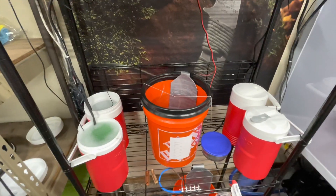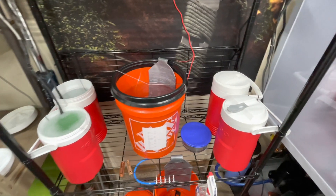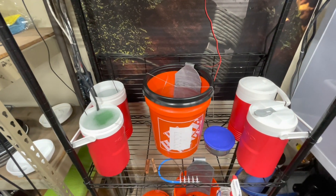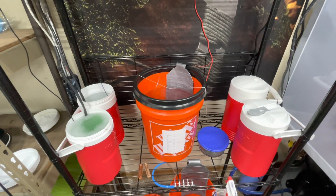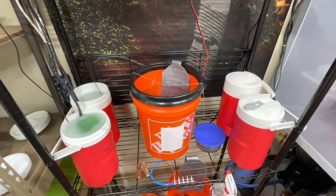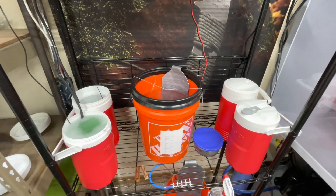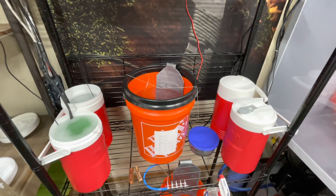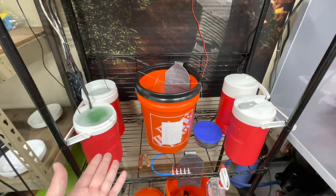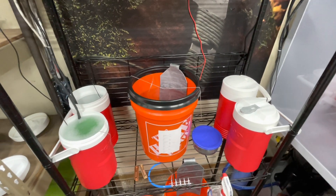Here's my setup. I'm not using sulfuric acid — I'm using sodium bisulfate, or bisulfite, I can't remember which. This is the actual anodizing bath. I didn't want to use sulfuric. It's not that hard to get — you can buy it in auto parts stores — but it's a pretty strong acid. This is acid too, and I'm sure it's just as dangerous, but it's easier to dispose of. It's a pool chemical, and you can buy it at Walmart very inexpensively. It comes in powder form and I saw some other people had good luck with it. If I ever want to switch to sulfuric battery acid, I can — that's the only step that involves the acid, so it's easy to switch.